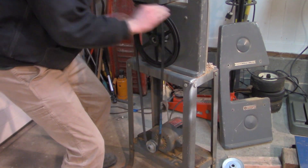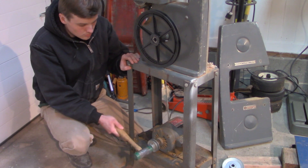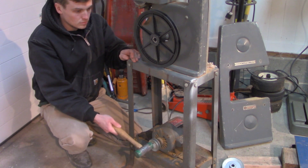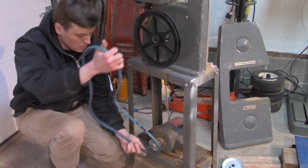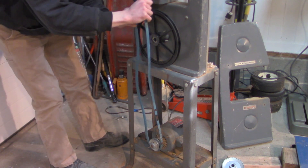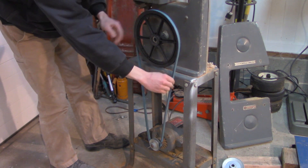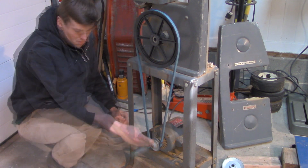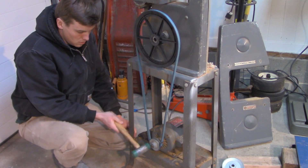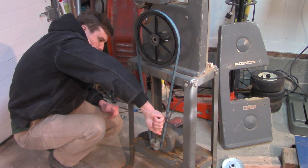You can see the pulleys are pretty misaligned. I scared myself — I thought my finger got caught in the belt. So I realigned the bottom pulley a little bit and tried to even it up with the top one. I got the new belt and slid it on, had to make some more finer adjustments to bring it right in track, and then tighten down the pulleys.